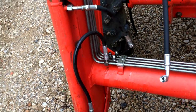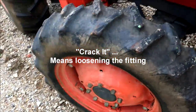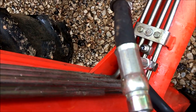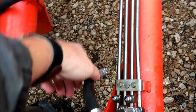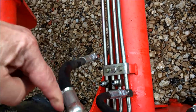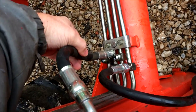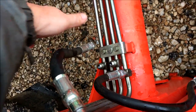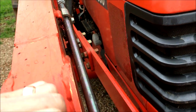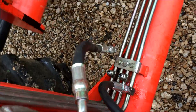Always crack it and just see what's going to happen — don't just yank it off. As you crack it you'll see it start leaking because there is fluid in the hoses. Gravity itself means that hose is full of fluid and it's going to drain out. Just thought I'd show you that real quick — changing hydraulic hoses is pretty easy to do.